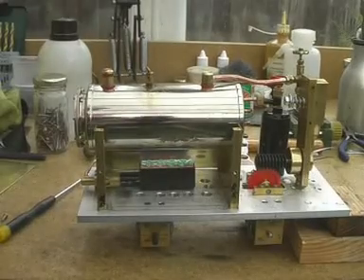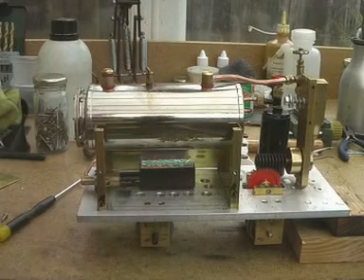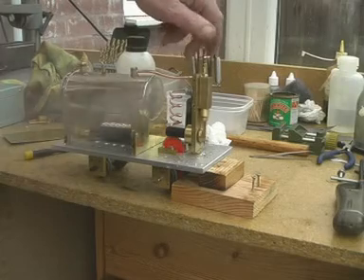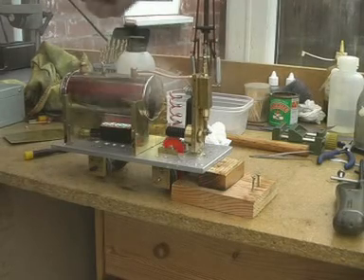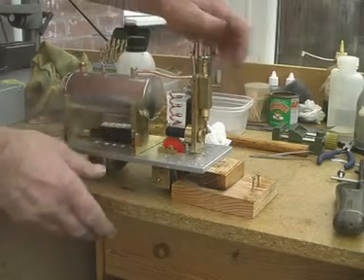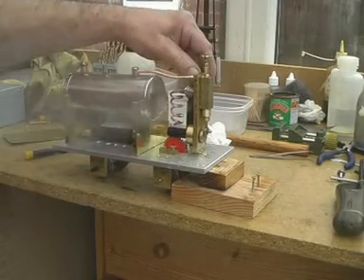Of course we've got no way of knowing what's going on when the side is on. We need a nice little mica window or something so that we can see through. Now how long will it run for? It will slow down and stop — there simply isn't enough steam. The regulator is fully open; the only thing I can do is put the burner up. Shut the regulator and put the burner on higher within a few seconds. The regulator is fully open but just after a few seconds it stops.